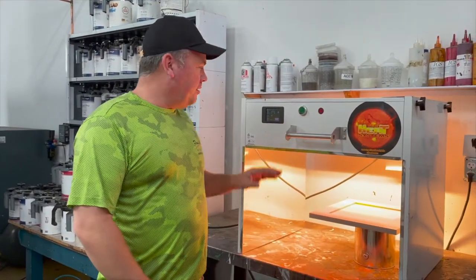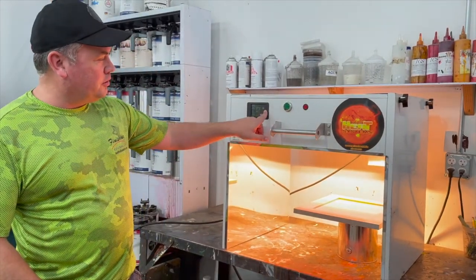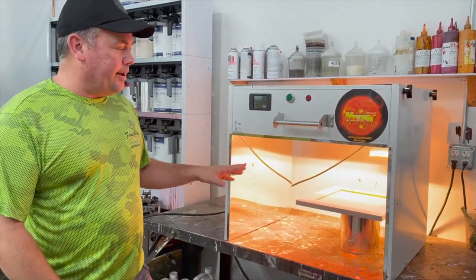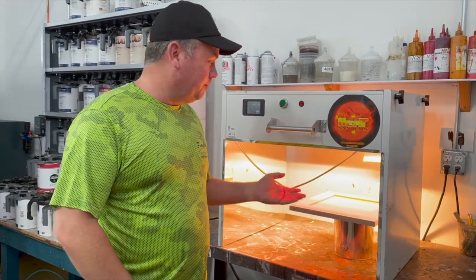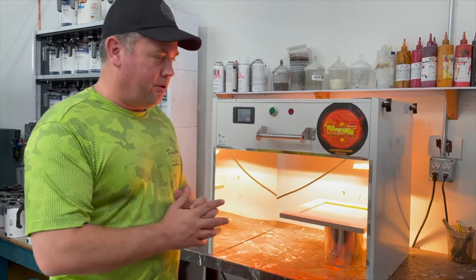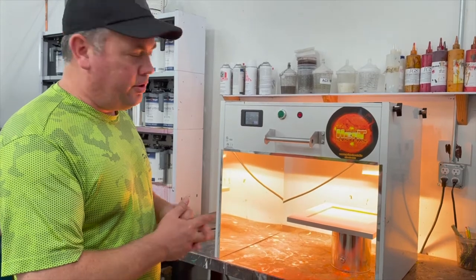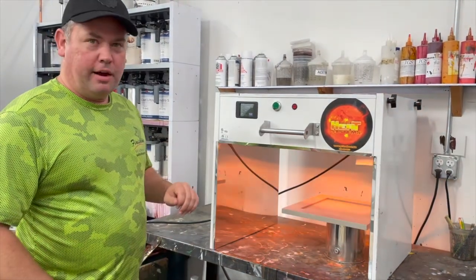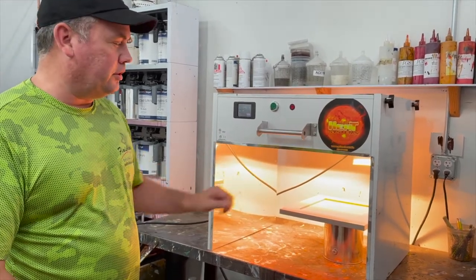We've gone into the short wave mode now, set at 3 minutes at 150. The part temperature was at 130 and we're getting even faster now, putting a lot more energy into the part. You want to make sure you have all the solvent out of the coating before you get into any short wave. That is true with water or solvent — you can use this technology for any type of coating. We're just trying to get the solvents or water out of the coating as fast as we can before we hit it with short wave, which is really going to lock it down. When the part gets to temperature, it turns the light off, and when the part gets 2 degrees under the set point, the light comes back on — so we're always accurate plus or minus 2 degrees of our set point.